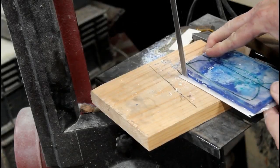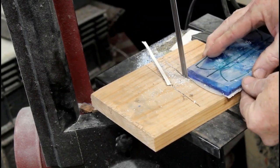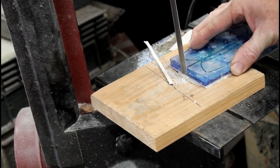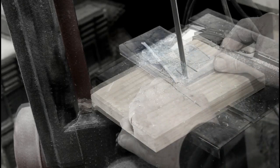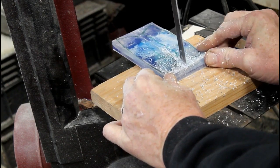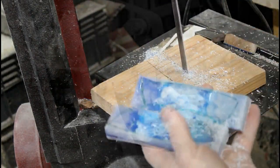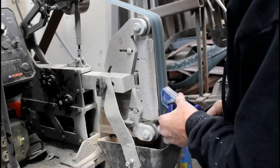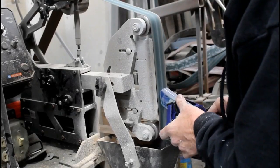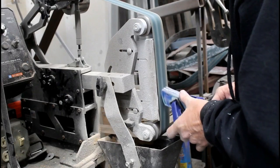This is a 24-hour epoxy that I use to glue the liners on, but usually four hours later you can start to work with it. I trim off any excess just with a bandsaw, then cut that scale material in half so I have one side for each side of the handles. I use the NorthGuard system to mount my handles. I finish and polish the front edge of the handles on the 2x72, running through a few grits up to a fine grit and then polishing — because you can't polish it after it's mounted to the blade.